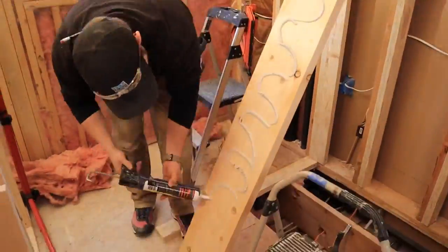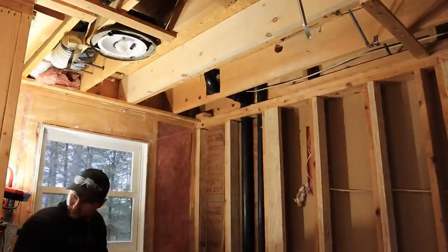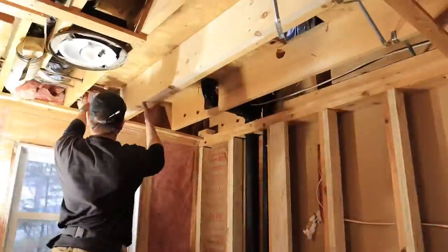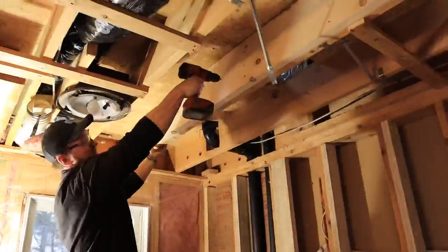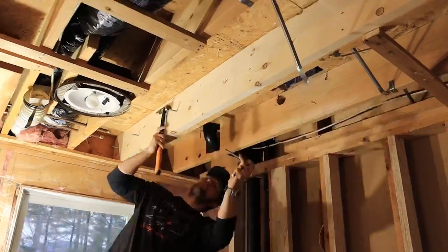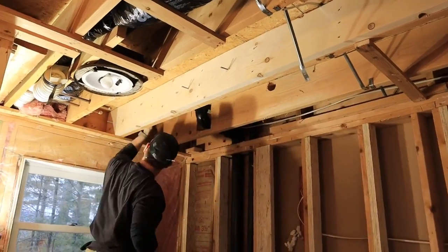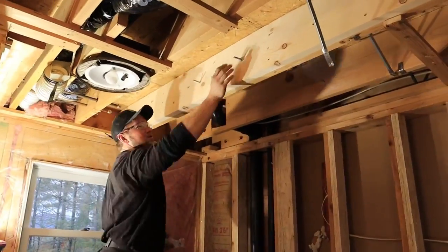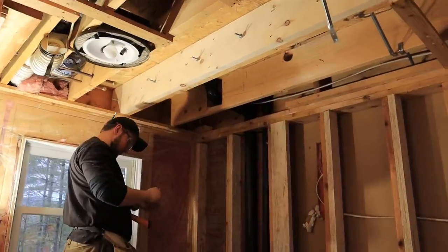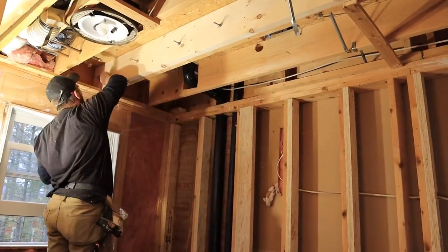First, I'm putting really strong PL glue onto this 2x10 and putting it up next to the beam that has the problem. I'm doubling this one up because my entire shower upstairs is resting on these two beams — I want them as strong as possible. I made sure it overlaps my outside wall and the hallway wall on the right side. I put some nails in to hold it in place, then pre-drilled some 3/8-inch bolt holes to get a nice squish and really laminate that glue.